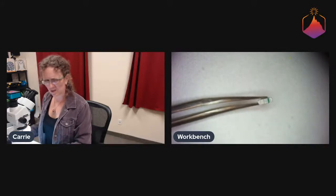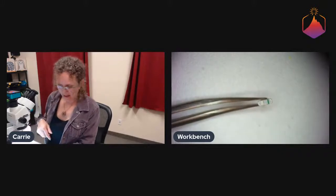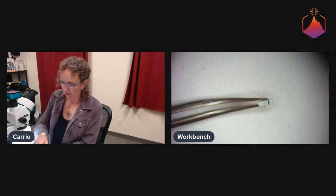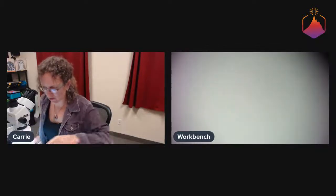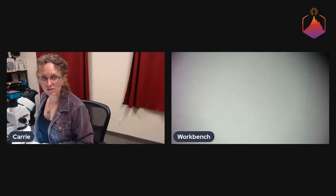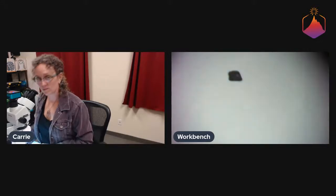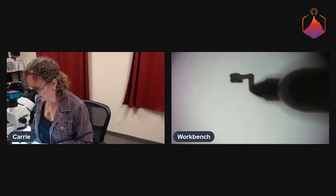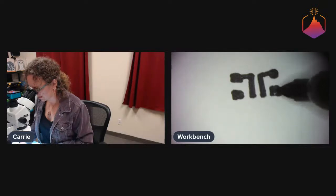And you're like, well, how do they actually make it down to the board if they're on the top of this LED? They make this little L, or upside down L. Let me see if I can draw this super quickly under a microscope, because why not? I'll just do this. If you're looking down at the LED, and the LED is going through the board, it's like the top pad here. Ooh, that's a little blurry. There we go. Top pad there, and it goes to an inner one. And this is what RGB side mount LEDs look like.